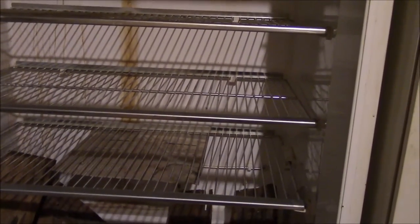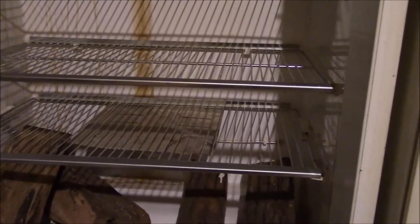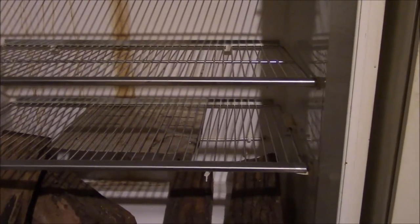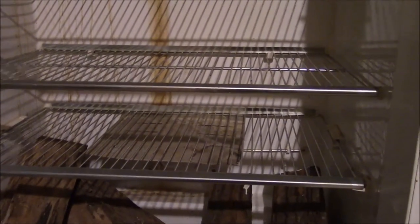This is the repurposed refrigerator. Unlike the ones I've seen on YouTube where most are circulating air in and out, this is not that way. It's a sealed environment where all the moisture that comes in from the roughed-out bowl blanks stays in here and evaporates very slowly. The important thing is that you fill it right to the rim — you want a real moist environment. It takes about two weeks to drive the moisture out, and I monitor that with a moisture meter and also by weight.